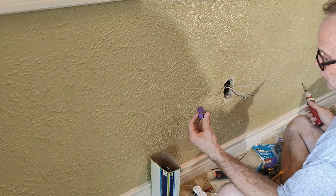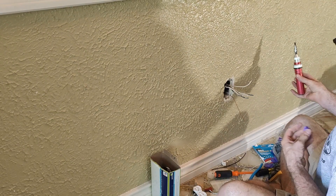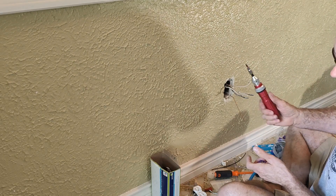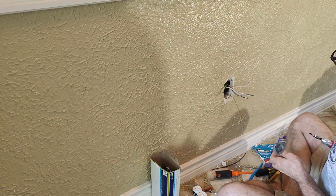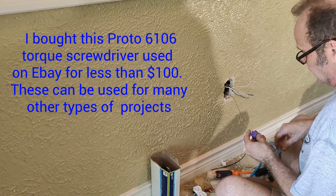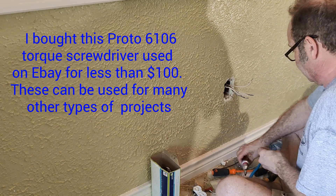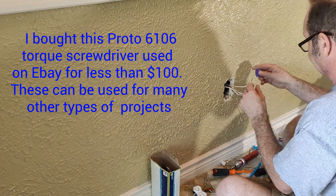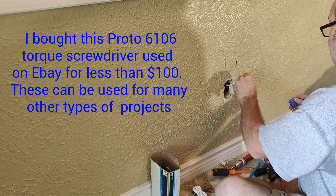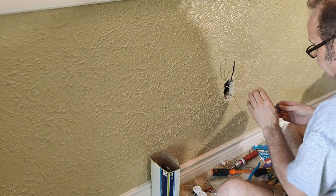It's 15 pounds if you're doing the heavier kitchen circuits, but this is lighter so I've got my torque wrench set at 10 pounds. You can get these — this is a Proto — at different places. I think it's a really important part of it to keep the current flowing well through the wires by having these torqued down correctly. It's a good idea.